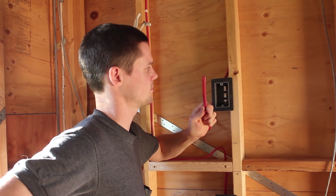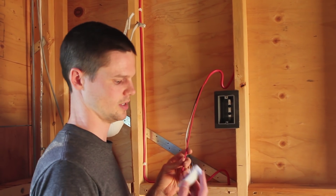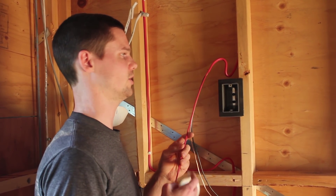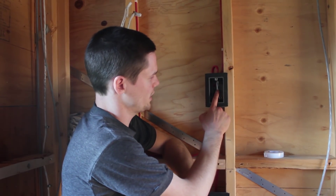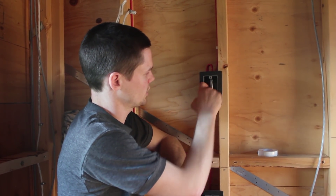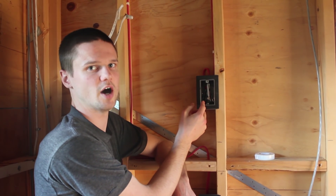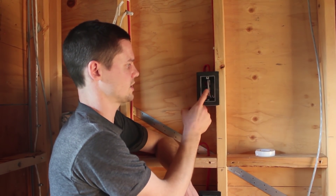The only difference is that I need to identify the neutral. I've got the wire stripped and ready, and I'm going to wrap this red wire in white tape all the way to where it's stripped to make it clear it's the neutral. With the neutral made white, there's no mistaking it. It's generally good practice to leave the hot unstripped or capped off, because if you energize a circuit where a device is missing somewhere, that box could have bare hot exposed, which is dangerous.